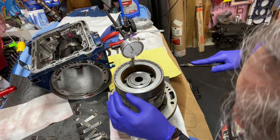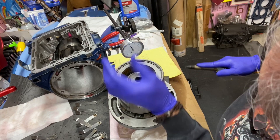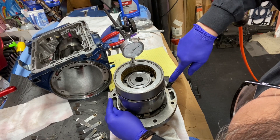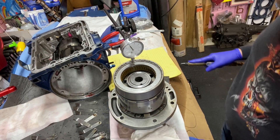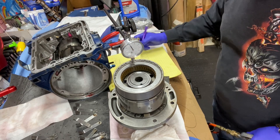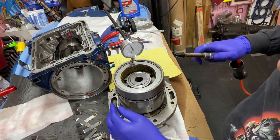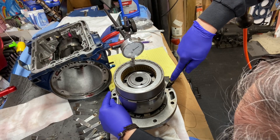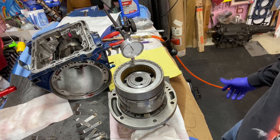Then we'll air check it. It's off by like half a thousandth. That's 23, almost 24. So 23 plus 4 — that's 27 thousandths right there. Could it be 28? Yeah, it could be. But we're going to say 27. Let's check it again. When I do it there it's really close to 24. So 24 plus 3 — 28 thousandths. I don't think it's going to make that much of a difference being that close.